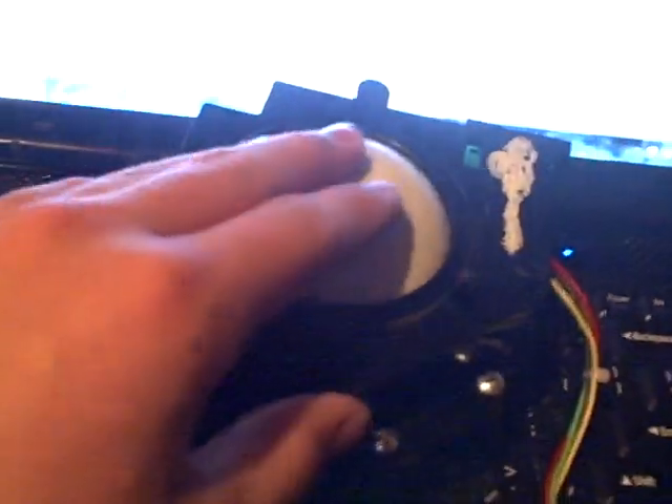This is my trackball mouse hack for the trackball on my main arcade machine. As I move around the trackball, you can see it's moving the mouse. The way I did that was I have two wires coming from one of the light sensors, two wires for five volts, and two wires for the other light sensor for getting both the X and Y axis.